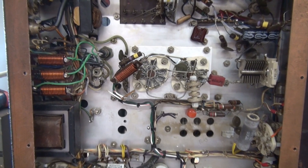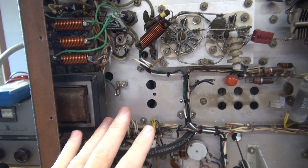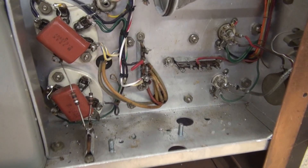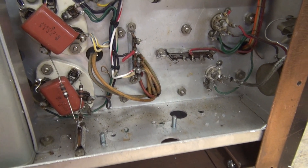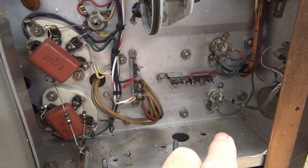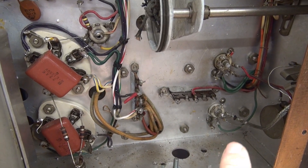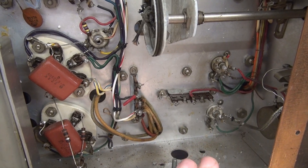The initial clean-out is complete. I removed that open modulation resistor, the cluster filter caps, and pulled everything out of the audio section. Next, I need to take some solder wick and needle nose pliers and clean the terminals of those 6AU6's so they can be rewired fresh.